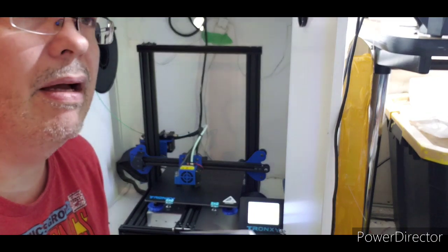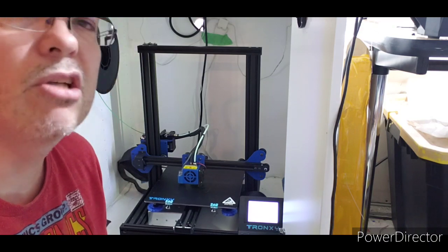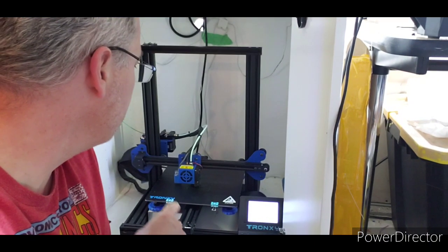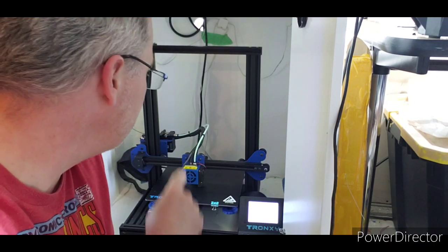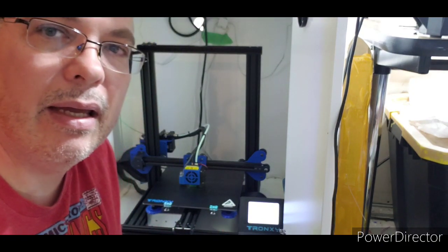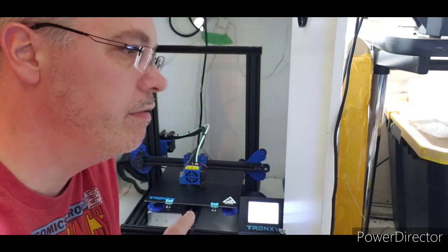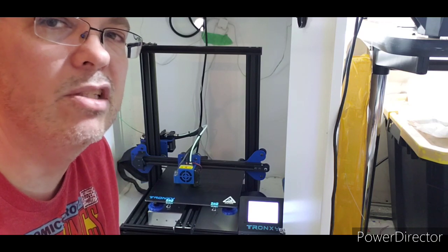When I do a Prusa Slicer video for this, I will show you my starting G-code, because one thing that people seem to have a problem with on this printer is the automatic bed leveling. They can't quite seem to get it right. As I say, I've been playing around with it for about a week now, and I think I got it pretty much dialed in. It's just a matter of a couple of steps. So I'll touch on that in the next video on this Tronxy.